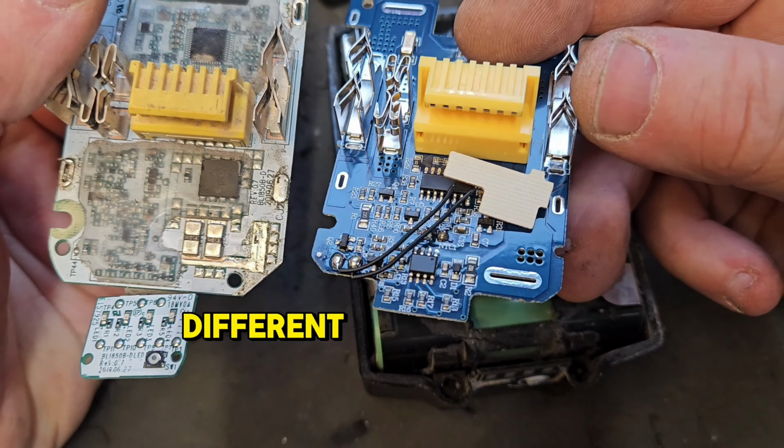So that's a 20 volt battery when it's fully charged. So 2.4 volts is not great. When you have a battery showing a very low voltage like that, you usually have to bring the voltage up somehow, and the jump start method is usually the go-to for everyone. But I would always recommend you open the battery and check the individual banks of cells before we go storming in. So we'll just get this battery open here now.